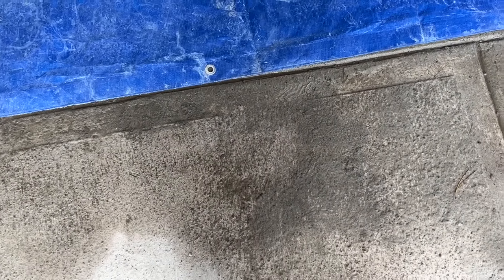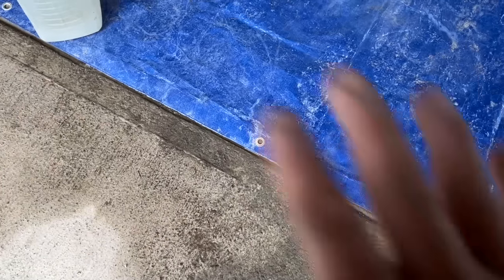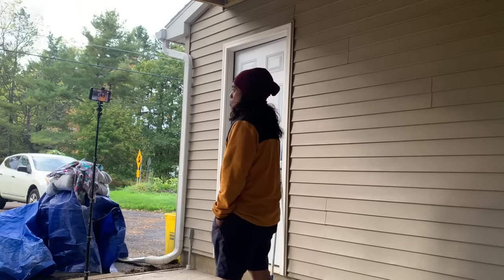Another mistake: when I was doing this slab I didn't cover this area, so when I was screeding you can see some concrete came over to the other side with the two-by-four running back and forth. Next time I know to cover it — I had planned to, but I was racing against the cold weather. I thought I could wash it off, but I couldn't because there was a fresh slab underneath the tarp. Special thanks to Greg Vancom at gregvan.com, Steve from Creating Concrete, and Michael Built. Thanks for watching — see you on the next one.